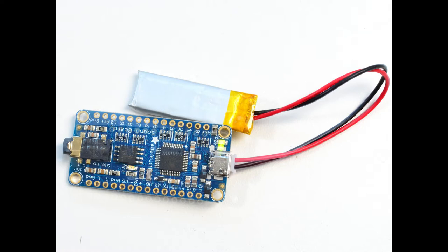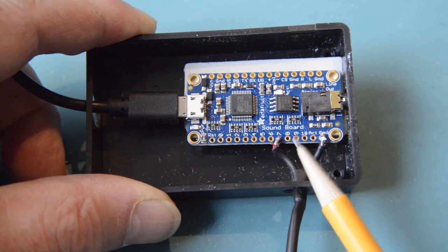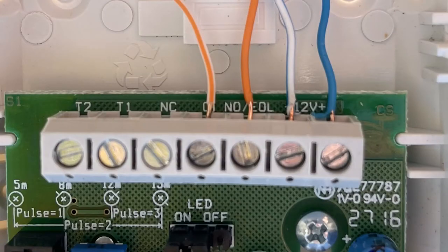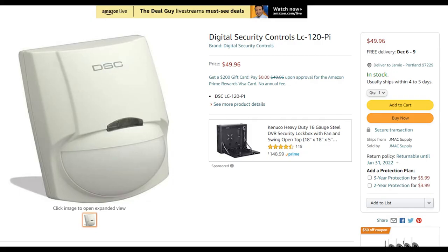You could also use a lithium polymer battery if you needed more portability. The card has 11 trigger ports. You can trigger the sounds to play with either a button, a motion sensor, or a step pad. If using a button, make sure to use a momentary type button and solder it to one of the trigger ports and ground on the sound card — in this example, I used trigger number 7. If using a motion sensor, be sure to use one that has normally open terminals. Most motion sensors are normally closed, and if you use that type by mistake, it will play the sound files continuously until it senses motion and then stop — the opposite behavior from what you want. I have a link to the motion sensor I used in the description below.